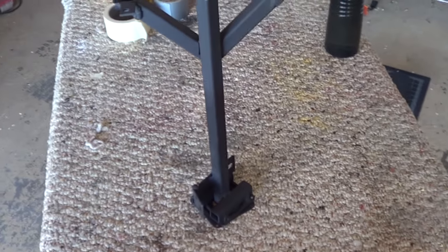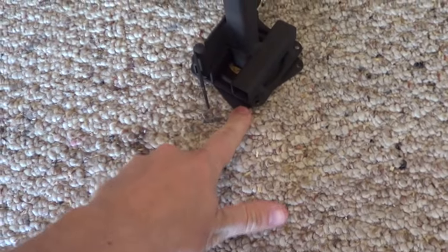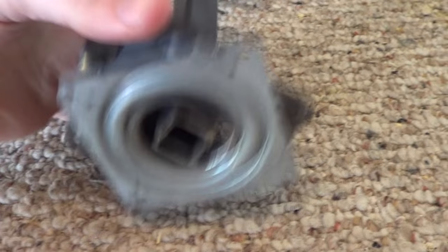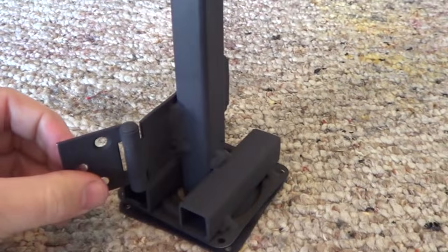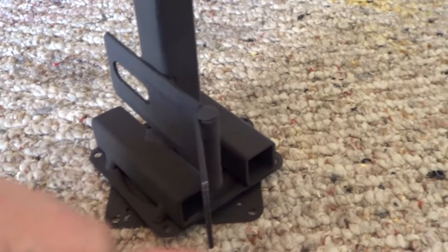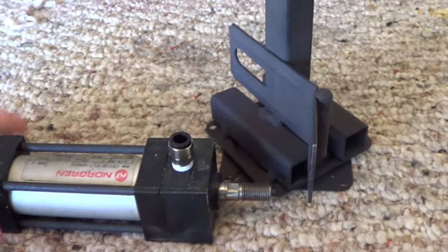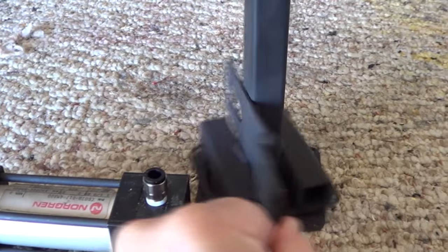This is the mechanism that's hopefully going to make this thing work. It's going to be down at the hip level, and the shoulders are somewhere right about in here. I used these little 3-inch Lazy Susan bearings to allow this to spin, because we're going to spin the shoulders 90 degrees. We welded on this little hinge here, and the air cylinder is going to get bolted to that hinge.